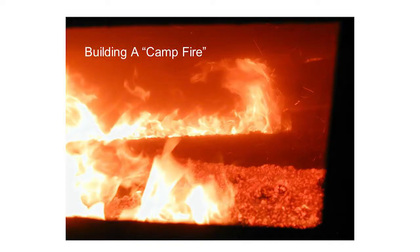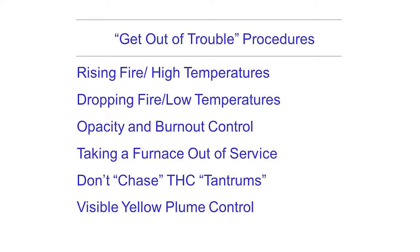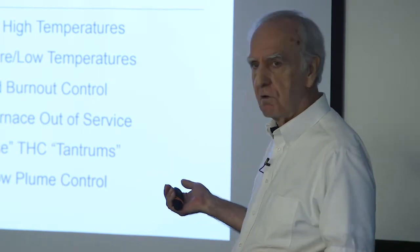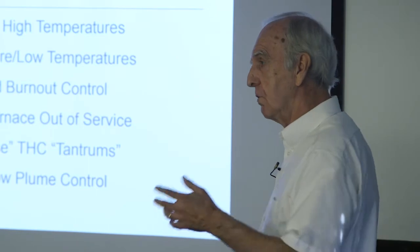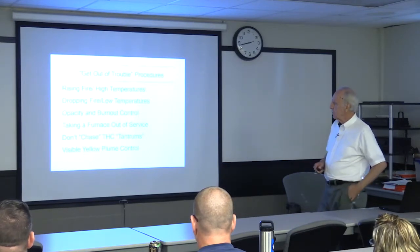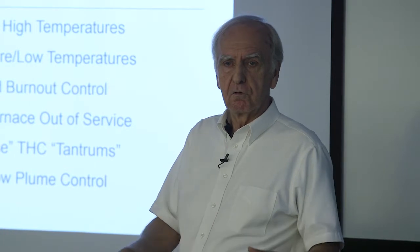Let me review these get-out-of-trouble procedures. A rising fire high temperature condition indicates that the heat input is more than what you need for the cake feed and quality you've got — this happens when you have a feed rate interruption or the cake dries up, and the burner use pattern is more than what you need. Conversely, a dropping fire low temperature condition: feed rate has increased, cake solids have wetted up, and the burner use amount is not enough to keep the burn zone where it is and it starts dropping.